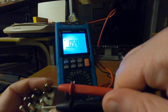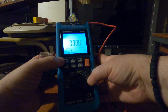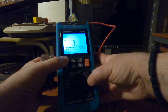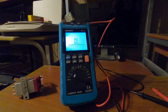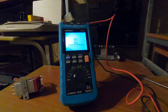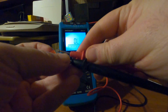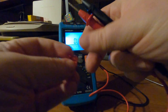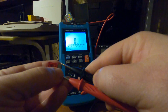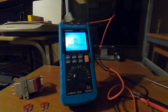So I can say that this OVP is still functional. Before you check this, you can also check the fuses. We have now selected the buzzer function — the first fuse is good, and the second one is good as well. So the fuses are okay.